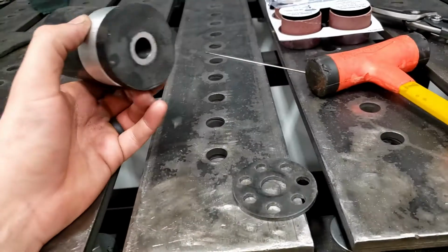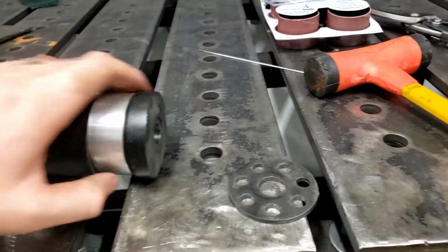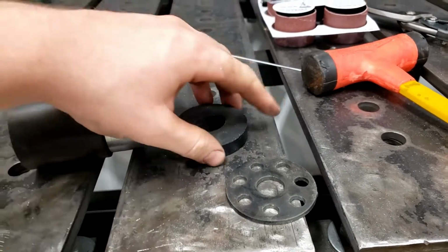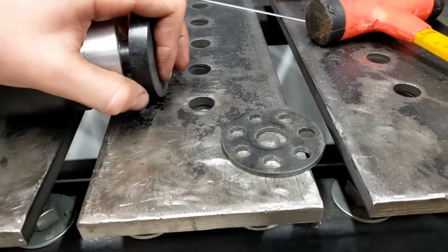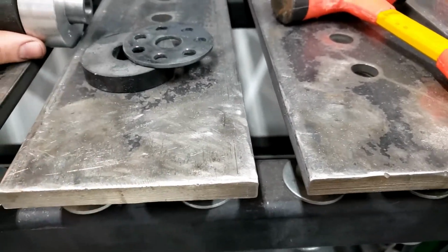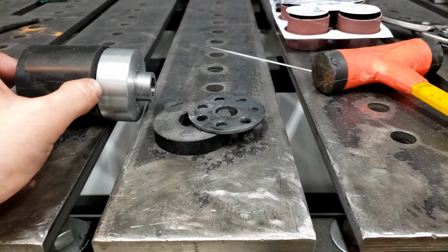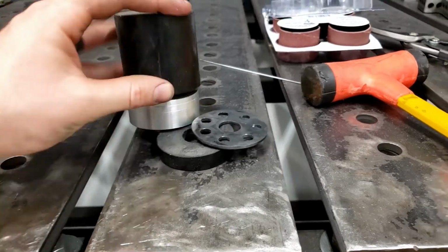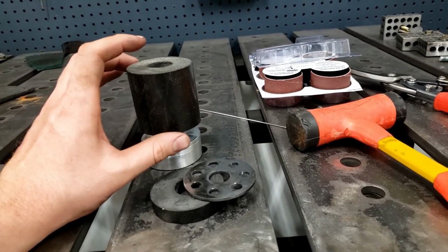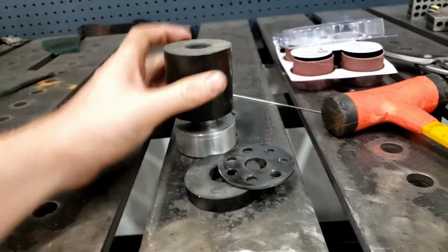Okay, so I didn't show the machining of the pucks on camera here, but I got these 1 inch aluminum pucks, and then these are the bottom spacers here. So what will happen is the chassis will be right here, then this bottom bushing will be right here, like that, tucked underneath, and this plate will squeeze it all together. So you have a 1/2 inch basically of tension on the bottom there, and then up top here we have a 1 inch hard spacer, and then this is a 2.25 inch bushing. Now actually it's 2.5 inch right now, but we're going to compress it down to our stack height, which will be 2.25 inch here. So that will take the cab and smush it down to where it needs to be.